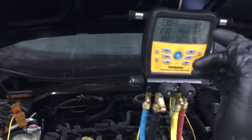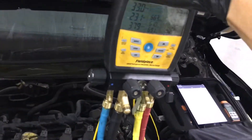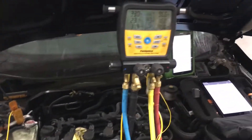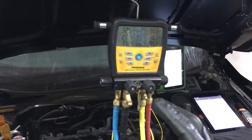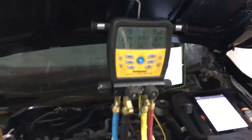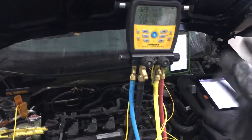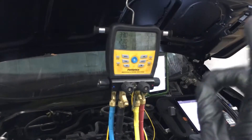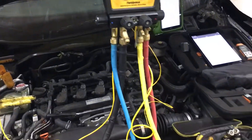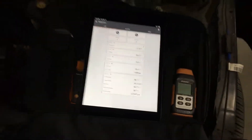For those of you who can't comprehend this yet, it'll take a while — it's something you have to learn after several thousand vehicles. The vehicles are changing again; now we have heat pumps coming to automotive. If you aren't used to heat pumps, the heat pumps in automotive are not operating the same as heat pumps in residential HVAC. So HVAC guys for residential: don't try to apply your residential knowledge to an automotive heat pump — you will get burnt, or actually the compressor will get burnt. Alright, I'll see you guys, adios.